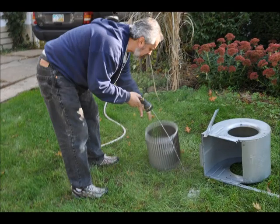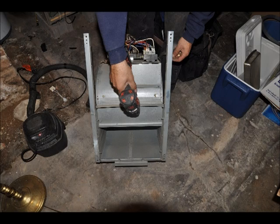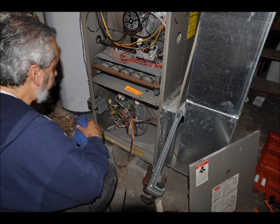Be very careful not to get the motor and system board wet during the hosing. After everything is dry, the blower and controls are reinstalled back into the furnace compartment. It is very important to perform a combustion analysis on all furnaces when repairs, cleaning, and parts replacements are done.